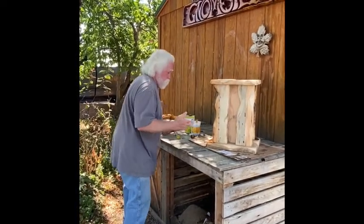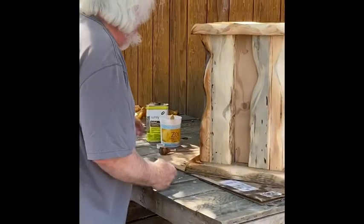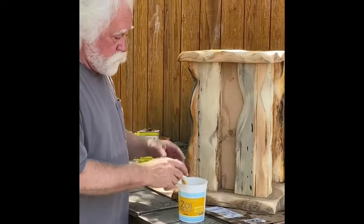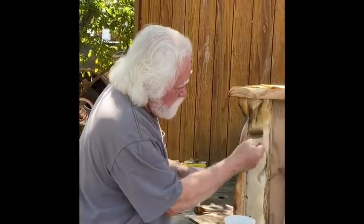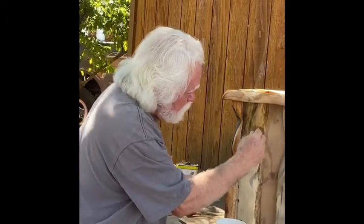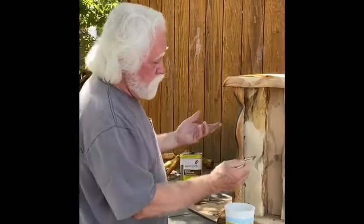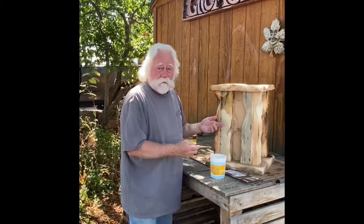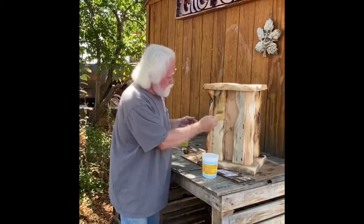This is now kind of a later phase — I've done the wavy gravy and the sanding to bring out the features of the wood and give it some color and character. Before I put polyurethane on it, I'm putting on some boiled linseed oil I had on hand. I'm trying to use it up — that's kind of the motivation here. I thought I was going to build this for free using scrap wood, nails, and plywood I had on hand, but then I had to buy some glue, so I'm about two dollars and fifty cents into it, which still annoys me. I'll have to tip it back later and fill the wormholes otherwise they'll be the wrong light color.